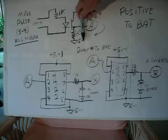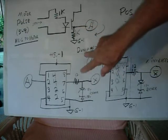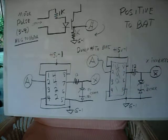G1 is here, so everything's got G1, and G2 is for the negative drivers. So you've actually isolated the grounds too, even though the grounds eventually will go back to the main ground in the system, which is the two batteries tied together. But I want individual pathways for the current to flow from the caps to the two different batteries. Even though it's the same ground, I've got two pathways, and one is used at one time, and then the other one is used at one time.